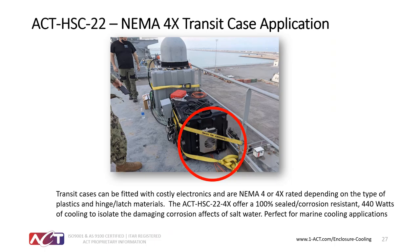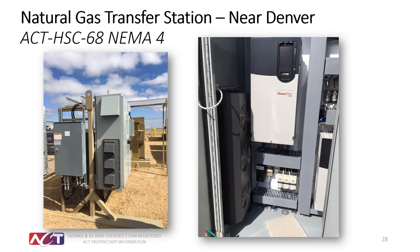Here's an application on a Navy vessel using a transit case. Technicians come out to do repairs and need their equipment inside a case resistant to salt spray, water waves, and other environmental hazards. The 4X stainless steel version of our cooler was used here. Natural gas pipelines are also a target for these products — you can see an HSC 68 cooler inside a gas transfer station in Colorado, where 1,400 watts of cooling capacity was needed to handle the drive installed in the cabinet, at multiple sites throughout Colorado.